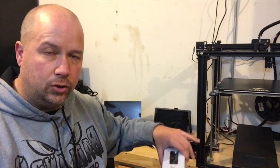the environment. Right now, I have a challenging environment. This printer area should be warm around it, okay, the surroundings. I'm actually in the garage in the Midwest, so right now it's about 50 degrees Fahrenheit in my garage. So it is pretty cold right now. And that makes it very challenging, not having an enclosure, to get a good print off of here.